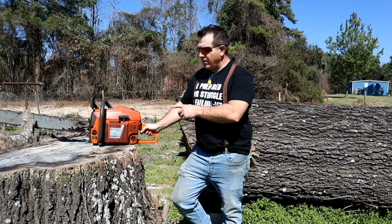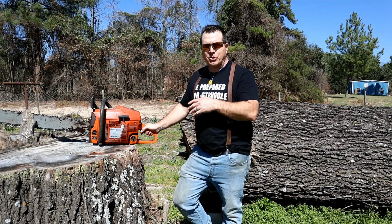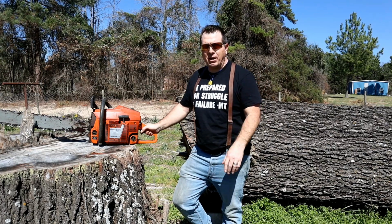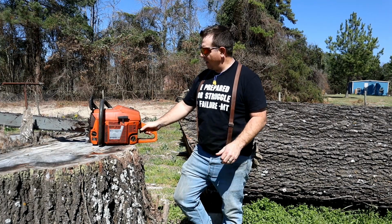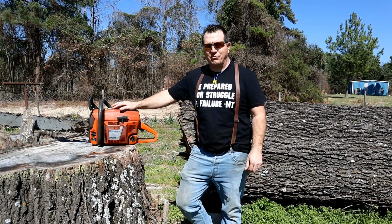Today's episode, I have got the 3120 all fixed up. You saw there in that last video, it was having some issues. Actually, super simple, cheap fix, free fix. Matter of fact, the screen in the carb was clogged up. If you missed that video, go back and check it out. But we're going to try again, but I'm prepared for struggle and failure.